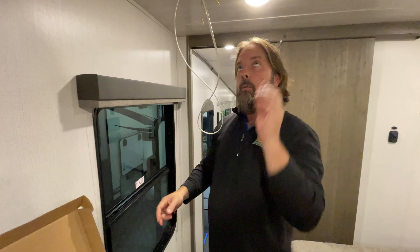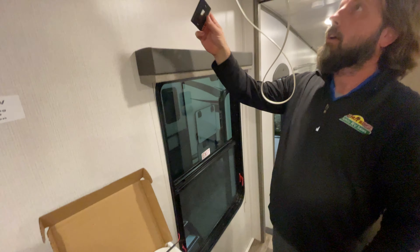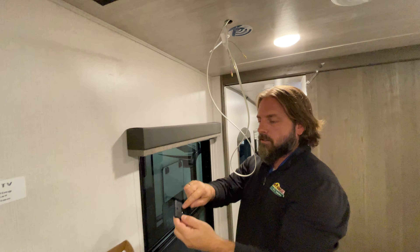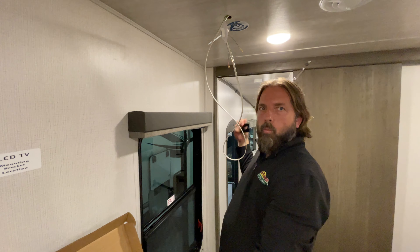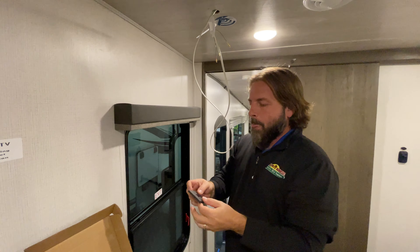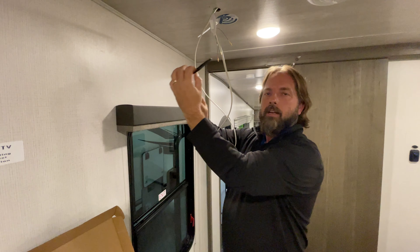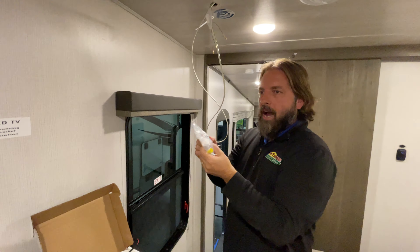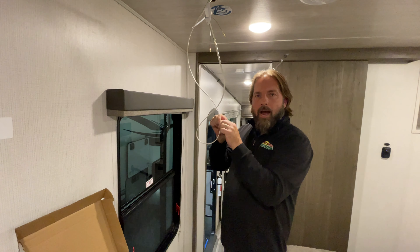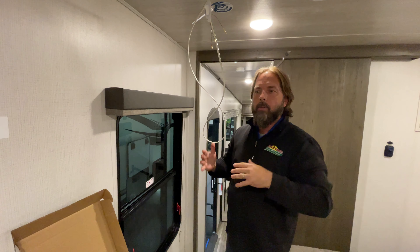You wire one side to a wire nut with a small piece of wire and spade connector to the switch, so you can turn it on and off. They also give you a plate in the kit to mount near the gateway for the switch. Instead of cutting a square hole like a standard wall switch, you just drill an inch-and-a-quarter hole and the plate covers it, with the switch clicking into place. All you're doing is breaking the power with the switch — on or off — and the grounds just hook together.